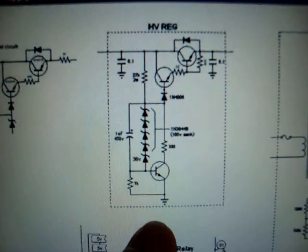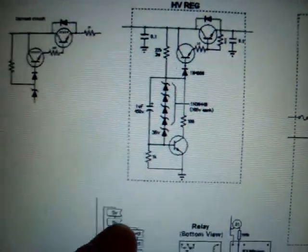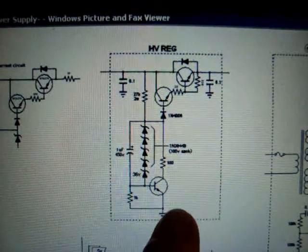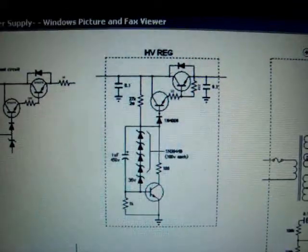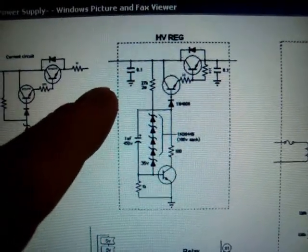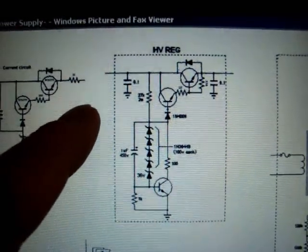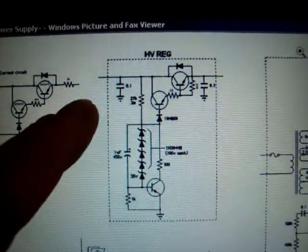Here's the HV regulator circuit. Nothing too fancy — he's got Zener diodes, and I've got a Zener buffer circuit here. Keeps the Zener stable. This works real good. This maintains the regulation at 440 volts output under all modulator loads — zero percent modulation to 110, 120 percent. This is really stable.